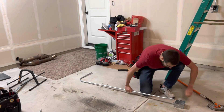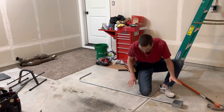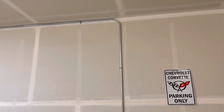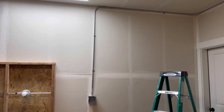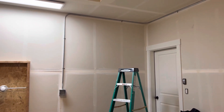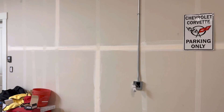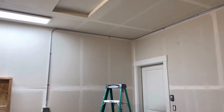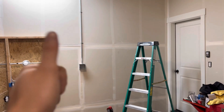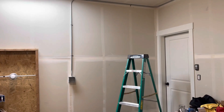Now it fits in perfectly — the box is sitting flush and we're ready to hang it on the wall. There we have it — our piping project: a box offset, up with a 90, hit the corner, another 90, another 90, box offset, and mounted the box. Hopefully you guys enjoyed this video and learned something about pipe bending measurements and deducts. Thanks so much for watching — if you enjoyed, hit the like button and subscribe. Check out Field Pulse in the link below. God bless, have an awesome rest of the day, see you in the next one.